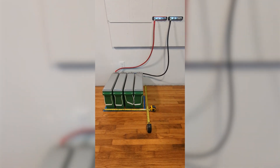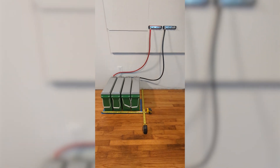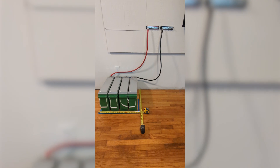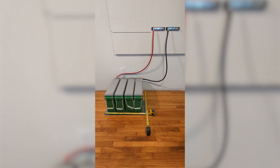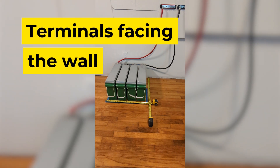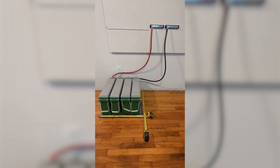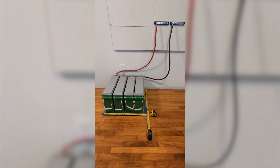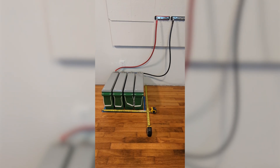There are a few things I want to talk about here. I put the bus bars up on the wall a bit higher because there's a good possibility I want to add four or even eight more batteries, and I need to situate the bus bars so that cables from different strings can reach them. I also put the fronts of the batteries — the side with the terminals — facing the wall so there's less cable running from the terminals to the bus bars. That means less impedance, and it's cheaper with shorter cables. If you're building a battery box, shorter cable runs make managing cables inside the box easier. And if I add four more batteries to the right, I'd use the same cable length to parallel each string to the bus bar, keeping impedance equal between the two groups of four.